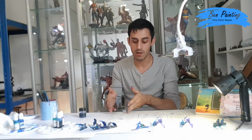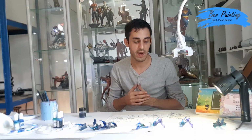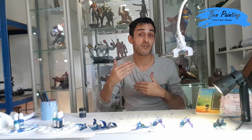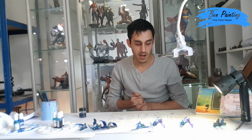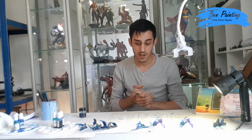Just as a quick recap, leaving it on the print bed after the print is finished doesn't really matter how long you leave it if it isn't in direct sunlight. Curing time is probably the most impactful thing to keep transparent resin transparent or clear. So I would recommend no more than 3 minutes of curing under a UV lamp. I use this nail salon thing, so very low UV lights anyway, and I only did 3 minutes. Furthermore, if you live in a warm country with sun, I'd recommend a bucket of water and just popping it in for a few minutes in the sun. But that is contingent on you not using degreasers and using a solid cleaning tool like IPA or acetone. I found that degreasers didn't clean it enough, so it would require more UV light to properly cure it, but in doing so, you're going to yellow the transparency. So it is what it is.